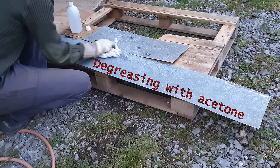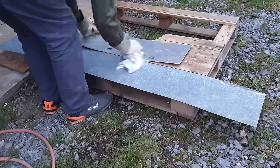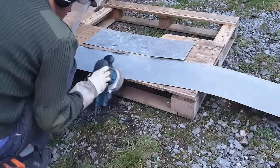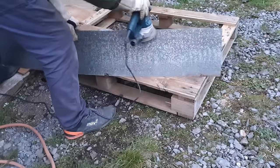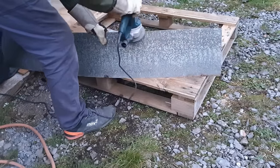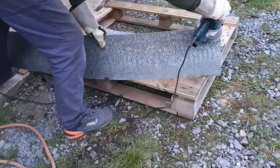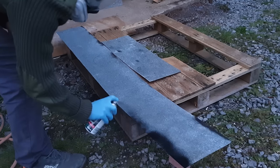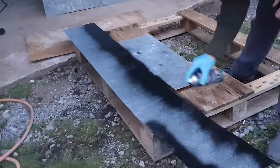While the multi-purpose machine I'm making here wants to be as versatile as possible, in this video we're focusing on the green sand mulling portion of things. Because it's going to be versatile, it needs to have really tight speed control. With an upcycled washing machine motor, this is possible but tricky.